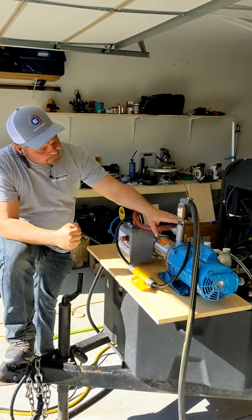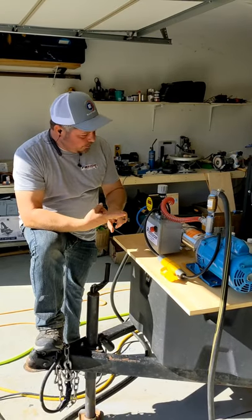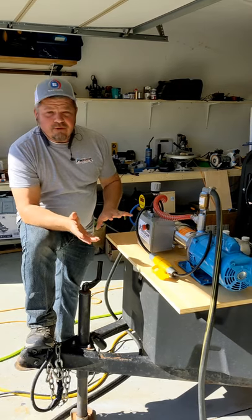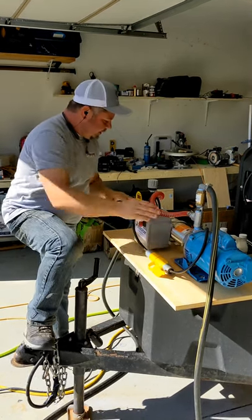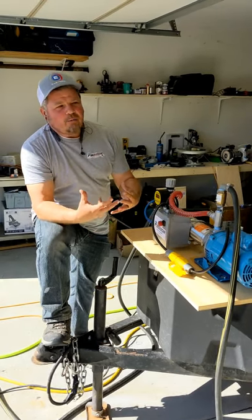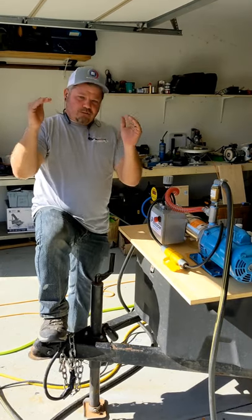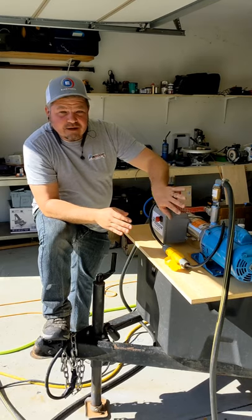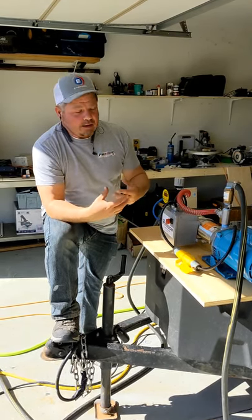I followed the manual here — I went with all stainless fittings on the input line and stainless on the output line, which is what the manual actually recommends. But at the same token, as you're in the middle of July and this thing's running on a truck — maybe 95 degrees outside — the booster pump will actually warm up, especially as you work. If the motor warms up, it's going to warm up the diffuser tube area. All these poly fittings have a great pressure rating at room temperature, but when you start warming things up to 120, 130, 140 degrees out in the hot sun, those performance charts start to drastically drop. By doing the metal input fittings as the manufacturer says, this actually acts as a little bit of a heat sink and a barrier before you start to transition into your poly fittings, giving you a better chance of avoiding cracks, breaks, and blow-ups on the poly fittings.